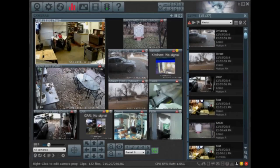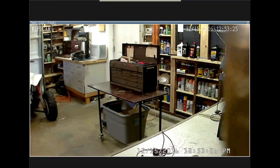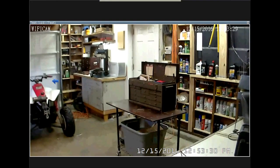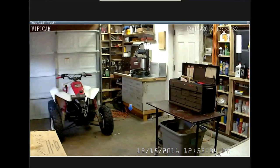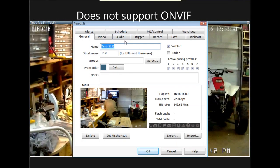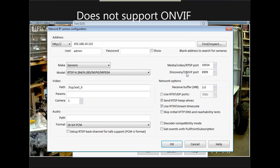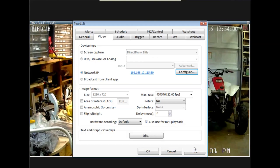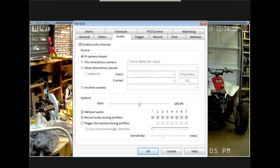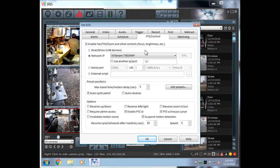Like I said, you could put an SD card in it. I use Blue Iris as my DVR software — I'll do a segment on that sometime. It's really good software and it does not come with the camera. It's free for one camera, or you can purchase it for $50 for up to 64 cameras. This camera does not support ONVIF scanning, so you put the IP address in manually. There's a path — I'll leave the path in the details; there are actually four paths and I got those from tech support. You can set the mode or model there, and for audio you just use the IP camera stream audio and enable it. By trial and error I also found out the settings for the PTZ functionality.